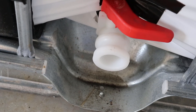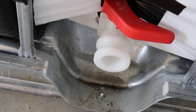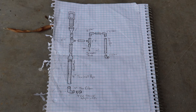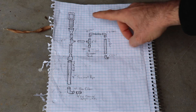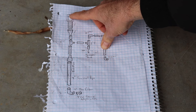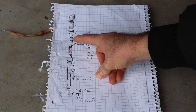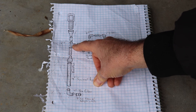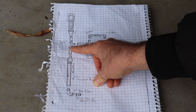Next I measured out all the plumbing I need. I have no idea what I'm doing, but here are the plans I designed based on some stuff I saw — LDS Prepper had a really good playlist on rainwater harvesting. I'm going to put a little filter with a finer mesh screen, connecting down from a four-inch to a two-inch conversion, then a length of pipe down to a T-adapter. That T-section will be my first flush, which is supposed to capture the gunky water from the roof — any shingle asphalt runoff.